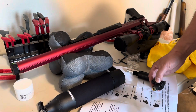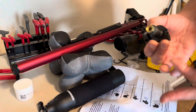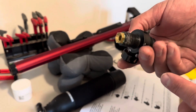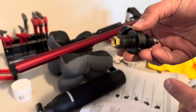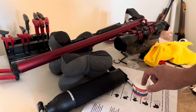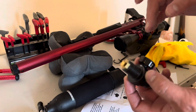The next part it's talking about here is: first, the valve is screwed into the regulator. You need to be sure that there's an o-ring in the regulator groove — so the o-ring is right here. This is actually quite dirty, so I'm going to give this a quick cleanup. I've had this gun for a couple of years and it looks like even with the water separators there's some kind of junk on that. So I'm going to apply just a really super light coat of silicone grease, kind of just to the threads and where that o-ring is going to seat.